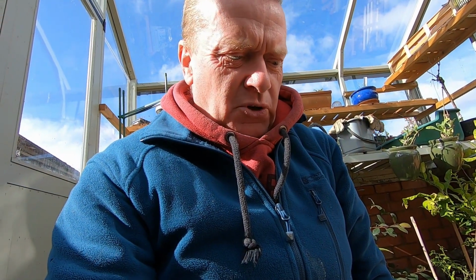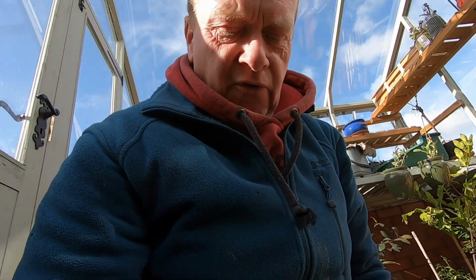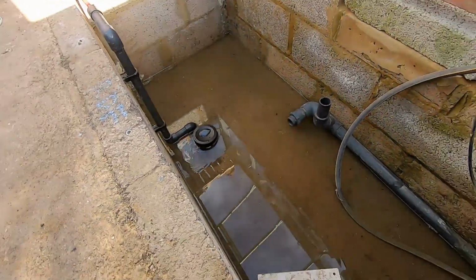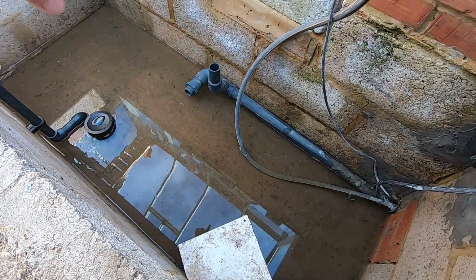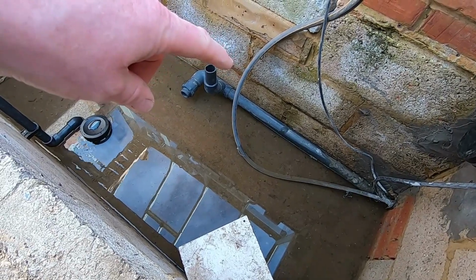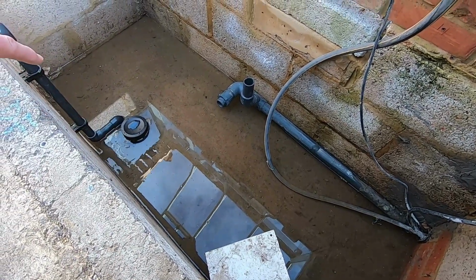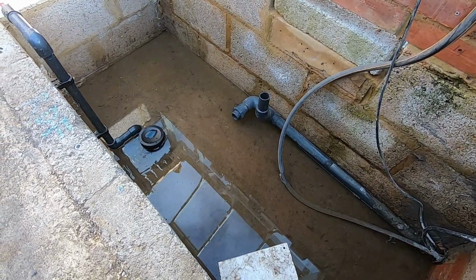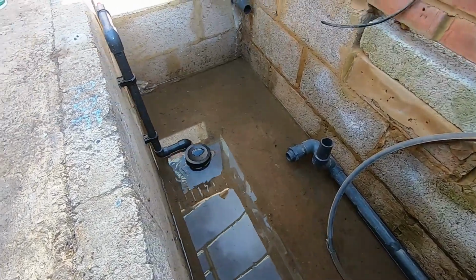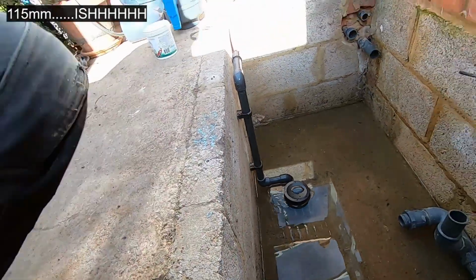Yeah, so I'm going to do some more spending. I've just ordered some bricks and blocks and paving stones from Wicks because I am going to build a plinth in here. So this will be 2 lines of, yeah, 3 concrete blocks, one in the edge, one in the centre, and one here. A few bricks just to give me the height, and then topped off with 2 600 by 600 by 40 concrete slabs. That will take me up to the height that I need, which is 115 below the filter pit. And fingers crossed that will work.